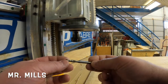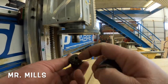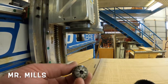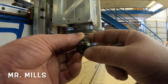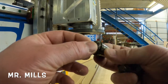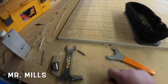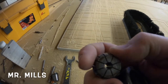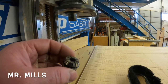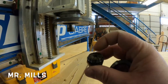Now I'm going to take the collet all the way out. There's some dust built up in there that you'll need to clean out. It's good to do this after every sheet or so — take the bit out and make sure it hasn't moved around and isn't full of dust. Clean the collet out by tapping it on the table and cleaning out all of those little channels. Then find the appropriate collet depending on the size of bit you have.